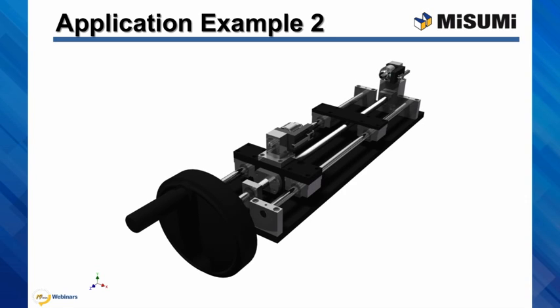Each shaft is also constrained with a shaft support at each end. You can purchase shaft supports with configurable height and control the mounting height of each pillow block within 100 µm increments.